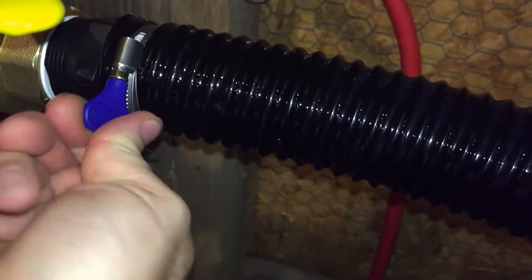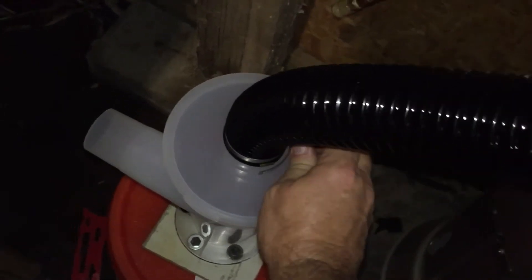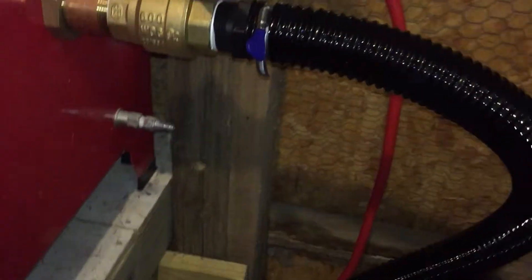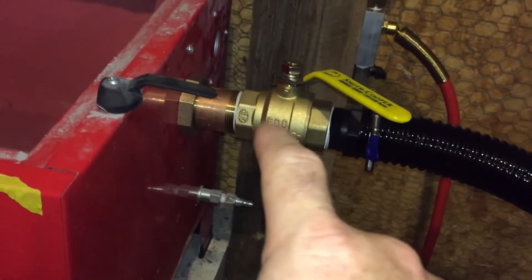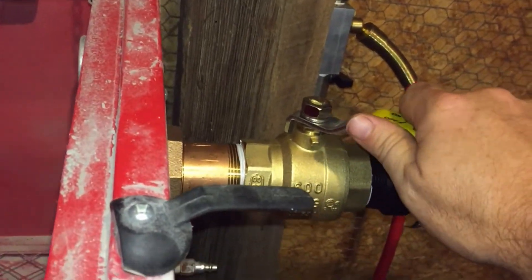It's just about adjusted out but it tightens up. Just tighten this up a little bit more. That looks a lot better. I'll hook my vacuum up to this and it will pull vacuum. I've left the filter in so it won't over-vacuum — it won't pull so much vacuum that it implodes. It's always going to have some air coming through. I can adjust how much vacuum it actually pulls with this valve.